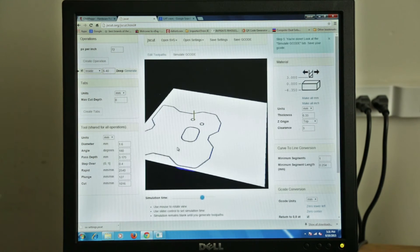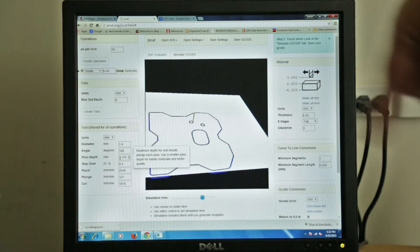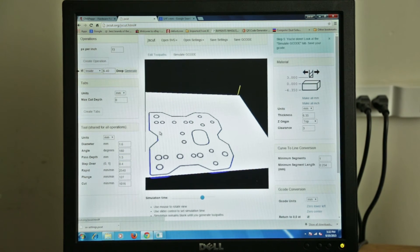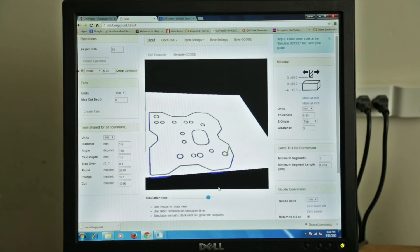There's one other thing I forgot: the pass depth. Your pass depth is how deep the tool is going to be per path before it cuts all the way through our quarter-inch. Since we're cutting 6.35mm, I don't want to cut that quarter-inch plate in two passes — I want to make this like 1.5 millimeters. Click enter, then click Generate, and it will regenerate with the correct pass depth of 1.5 millimeters per pass. If you run your simulation you'll see it makes multiple passes per hole — about six little passes — so you're not going to damage your tool.